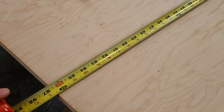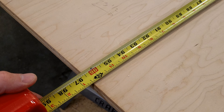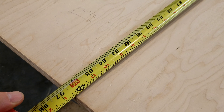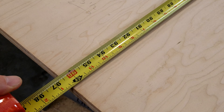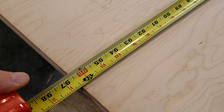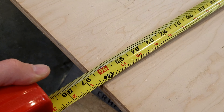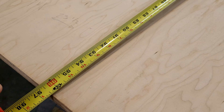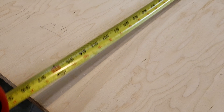The thing is, this plywood sheet is not your typical plywood you'd get at a home center. This is actually from a hardwood dealer — where I get most of my hardwoods — and it's much less expensive than a home center. This is cabinet-grade plywood. It's not 96 inches long like you'd find at a home center; it's actually 96 and a half inches. So I need to trim off a half inch, and I've got a simple solution to do that — I'll show you how.